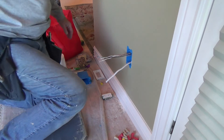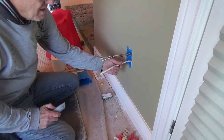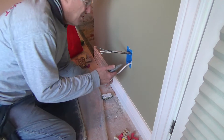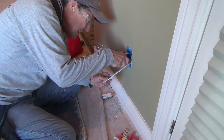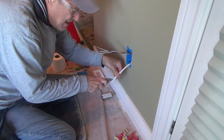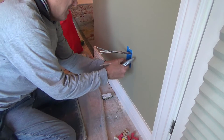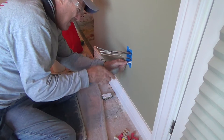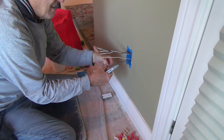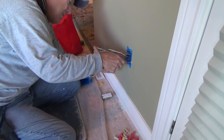This is the last thing I've got to do — put this back in, then I can turn the breaker on and check all my work downstairs. So I'm going to strip this wire, reach back as far as I can, just to there. Get your hand out of the way — you don't want that to slip. I always retract my knife when I'm not using it. Good way to cut your hand or your thumb if you're not paying attention.